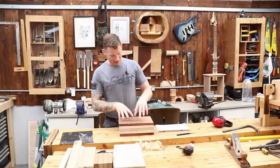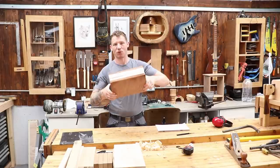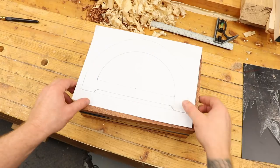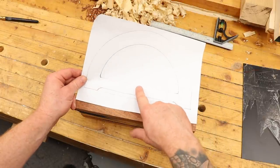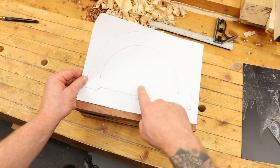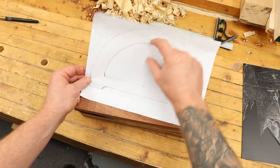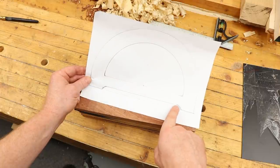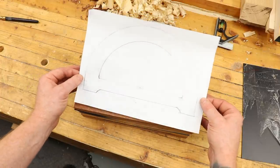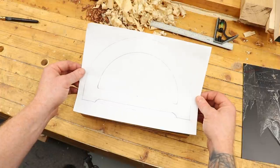All the pieces are already milled up and ready to go. This sandwich is going to be our bandsaw box — roughly just over four inches, just over 100 millimeters. I kept the design nice and simple: I picked the center point, took my compass and drew an arc, measured down about 30 millimeters and drew another arc from the same center point for the inner drawer. I measured down 30mm from that line to the base so both thicknesses match. Two little arcs for the feet, starting in line with the edge of the drawer — everything symmetrical. It's a bit of an experiment, so we don't want anything too complicated.